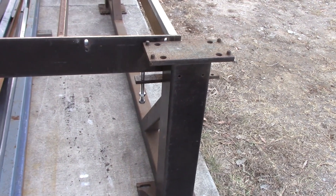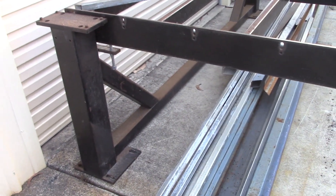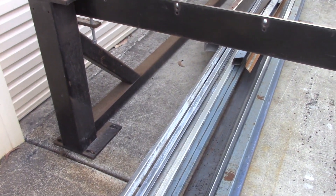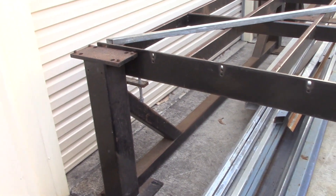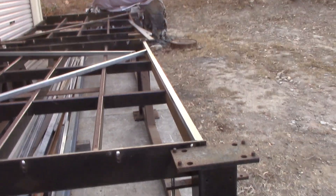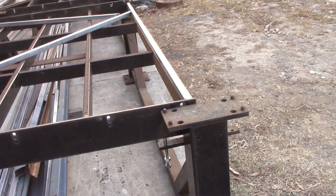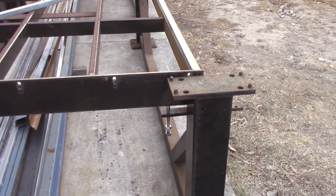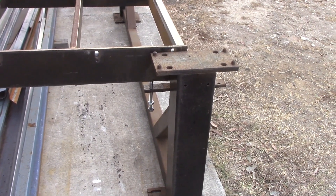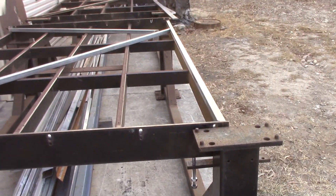This is the disposition of the bolts on the table. As you can see they fit up underneath into that bracket. There's one on each of the four corners — in fact there's provision to have two on each of the four corners. What that allows you to do is put the legs down anywhere and get your table perfectly level. Basically just get yourself a spirit level, set your table where you want it and move your bolts like little jacks until you've got everything nice and level, and then you're in business.